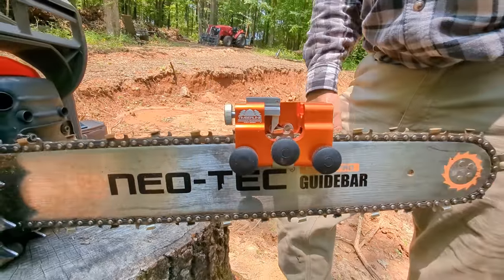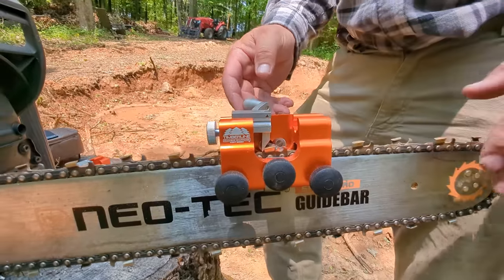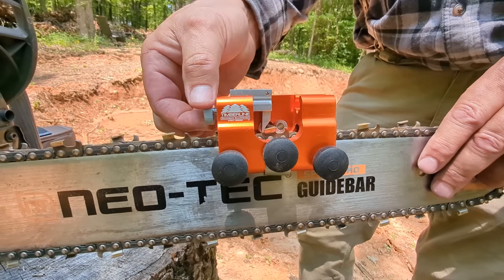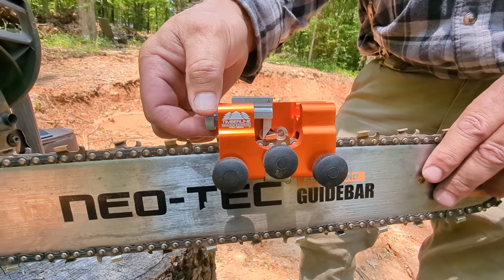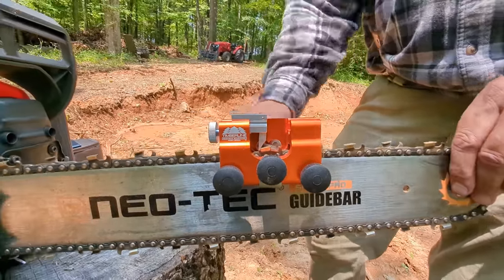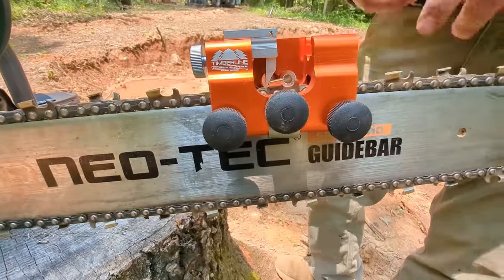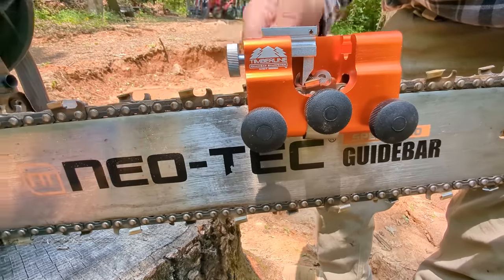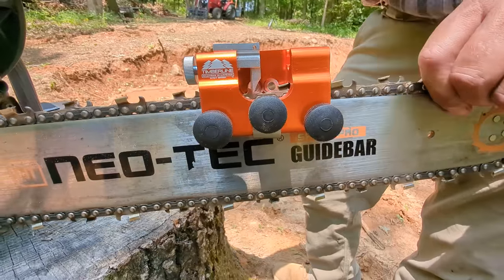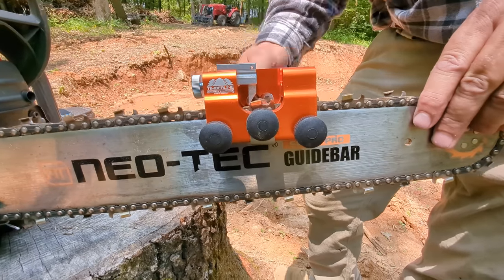So I had somebody on one of the last videos that, for some reason, when I did the editing, I never showed it sharpening the other side, and they're like, you only sharpened one side. And it's hard to explain sometimes to people that in the world of editing, things happen. I went ahead and backed that off just a little bit. When I went from this side to the other side, it was almost perfect. Just minor adjustments. I'll take it just a little tighter. But once you get it set up, and that's probably my rookie mistake, you can sharpen the chain really fast.